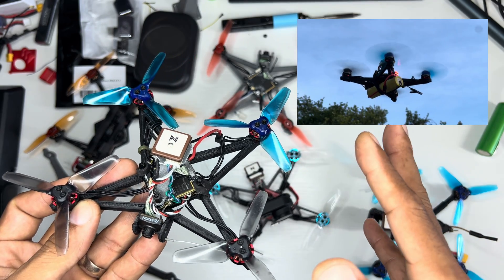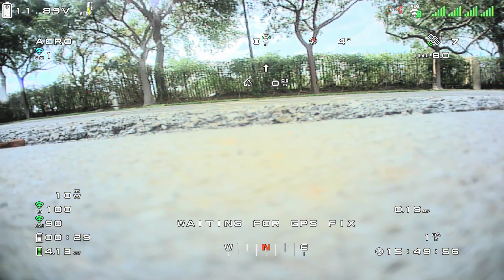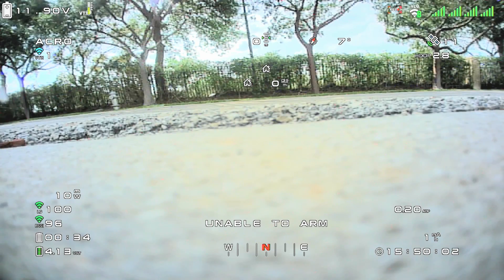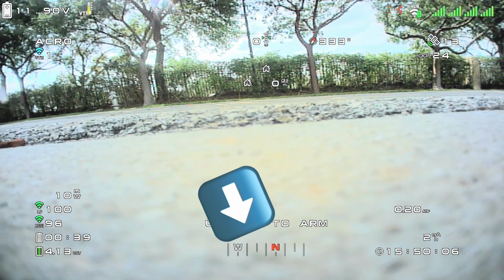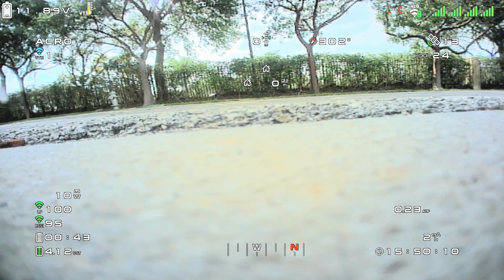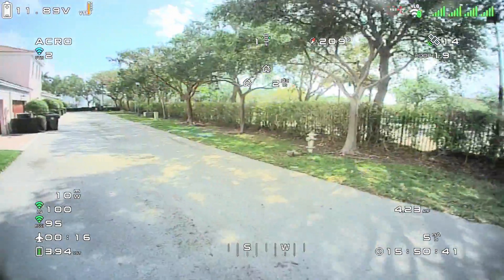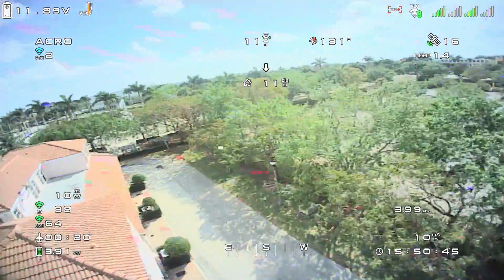This drone is running HD Zero. I'm going to try this test first with the compass turned on. You can see right away we have our heading shown in the OSD. As we turn on the drone it immediately senses a magnetic field, knows which way north is, and knows which way it's going right away. We take off and everything is working as usual — position hold works very well.